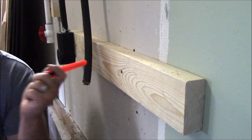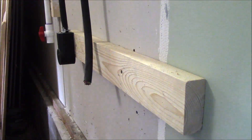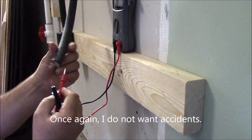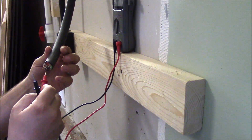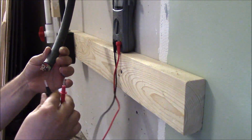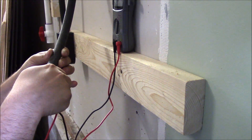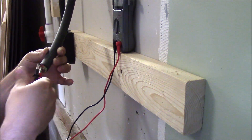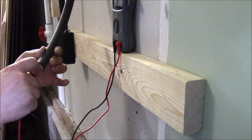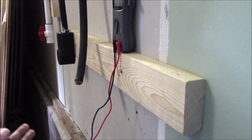I'm going to make sure that since this is already wired up in my junction box, it's a dead circuit. Just to confirm — even though I know it is because I have it off in the junction box — you can go from either the black to the green or the red to the green. If this were a live circuit, those would be giving you your 110 or 120 volts. Right now I'm showing zero. Between the black and the red, if it were live, it should be giving you about 220 to 240 depending on what service you have. Everything's dead — that's good.